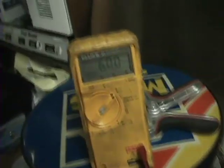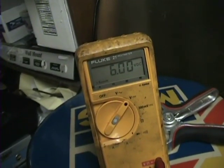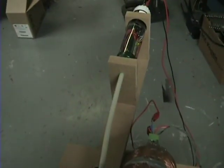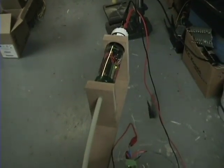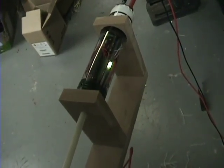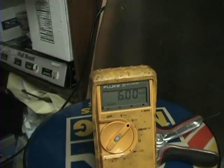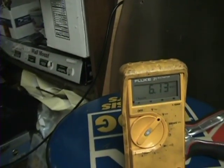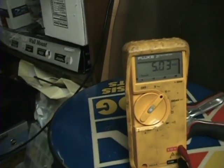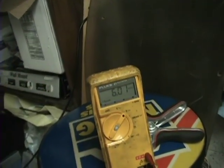The output is at six volts right now. That's the output of my magnetic field tester, and it will either go up or down depending on what it detects. Using this magnet against it, you can see my lights light up — that's south, that's north — and how strong the field is from the LEDs. If I take the magnet away it's right at 6.01 volts. Put this magnet on south, voltage goes up; take it off; put this magnet on north, voltage goes down. So that's my test setup — this will give me fine results and show exactly what's going on.